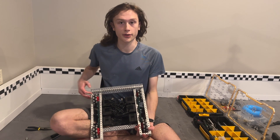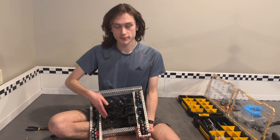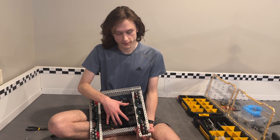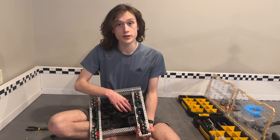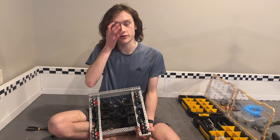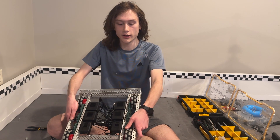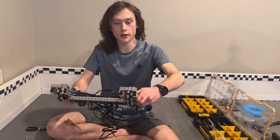This drive base is 333 rpm and it has six motors on it, two of which are 5.5 watt motors. This drive base is a flexible drive base as you can easily run this with four motors, five motors, or a six-motor drive base. All of those are going to work just fine for this robot. Additionally, this robot has advanced features such as a three-hole gap and using screw joints on our wheels.